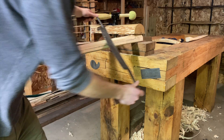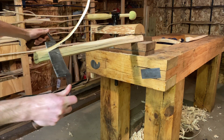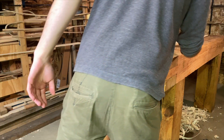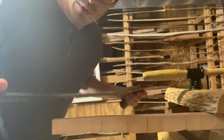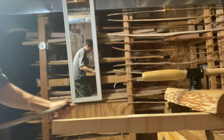Tip number five: how to deal with tear out, and in particular that situation where your knife gets stuck. Let's see if we can induce a little bit of tear out. First I'll show you some clean cutting — no problem there.